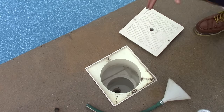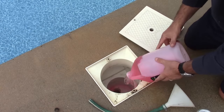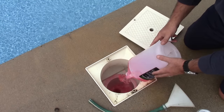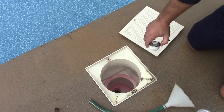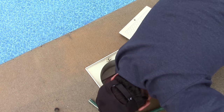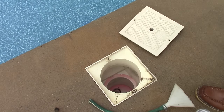We're back at the skimmer. There was a little bit of water in here, and when I closed off the valve it ran down the hole — that doesn't matter because we're going to put antifreeze in here. I use about half a gallon or so. The antifreeze will mix with any water, and it's just insurance so if a little bit of water gets in through the plug, it won't freeze. For this skimmer I'm using a plug because the threads in here are slightly cross-threaded, so I put a plug in there and tighten it.